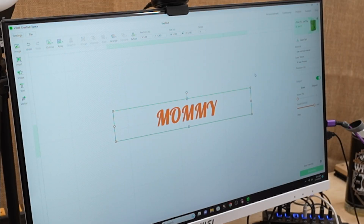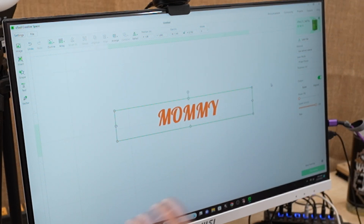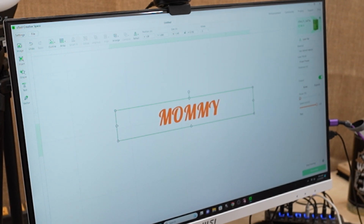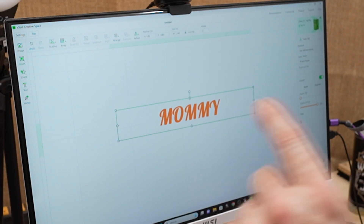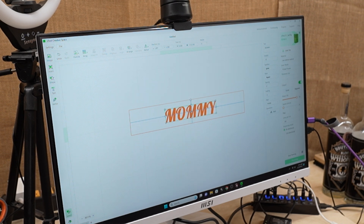Now in XCS it does give you the ability to ignore a layer, except when I have it hooked up to the F1 — I don't know why that is. So basically what I've done with this outside layer to keep my frame where it is, is I put the power down to 1% and the speed all the way up so it'll just run quick and won't actually engrave anything. I've centered this so you can just bring it in here and center it with the centering lines.